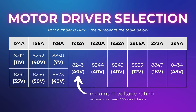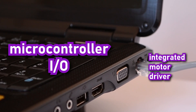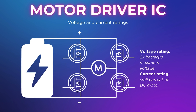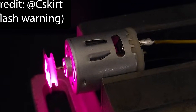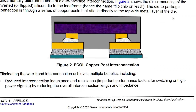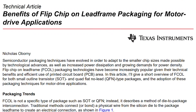For motor drivers, a table of some of the most compact and low-cost full-bridge integrated drivers from Texas Instruments is presented — these can essentially be plugged straight into a couple of IO ports of your microcontroller along with some passive components to start driving a DC motor. For voltage ratings, go with twice your battery's maximum voltage or more, and for current ratings, use your motor's stall current or more. This is because transients with large voltage spikes can occur in inductive loads like DC motors. TI motor drivers are recommended because many package the silicon die onto the lead frame in a way that is much more advantageous for cooling and space saving — called flip-chip on lead frame, or FCOL, packaging.